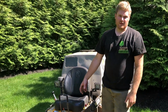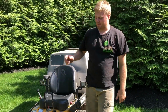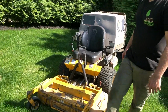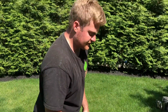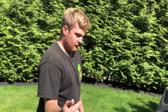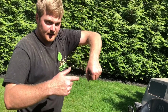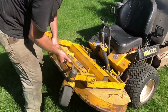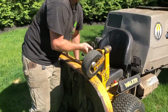One of these days we can make you a video on how to reseal and replace the gearboxes, because they have to be timed properly. We'll make the video. And there's a way to make it even more reliable: the bolts that hold the whole assembly on. The bolts that go in are just regular old bolts. You can get grade 8 bolts and put them through with a lock nut on the outside. I've done that before, or you can just get grade 8 bolts and thread them in if you don't lose your threads, because these are sometimes tough to re-thread.